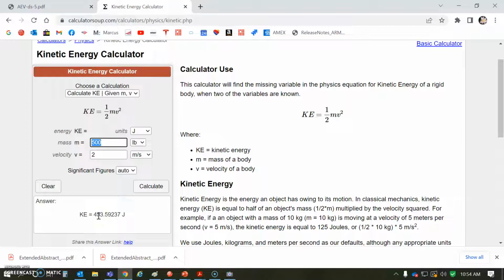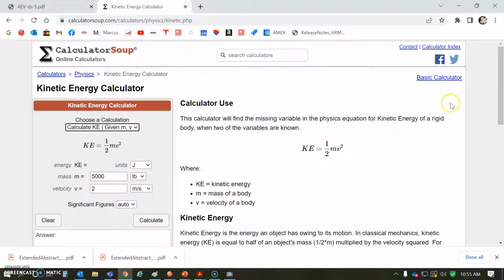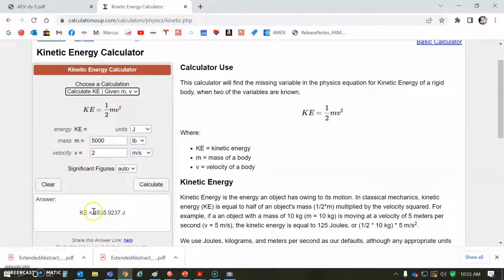With this motor, of course, you can get 2 or 3 or even 4 times the rated current for a short period of time for acceleration. But I'm just looking at the kinetic energy of going from no motion to full motion. How much joules do I need? And of course, we could do 480 watts for 10 seconds. So maybe that's a slightly larger mass. Yeah, so there's other places the energy comes out. The motor warms up, the gear inefficiency, the wheel efficiency. So maybe not that much mass. So there's a lot of other physics that gets involved with the vehicle.